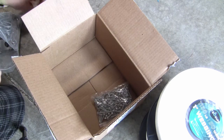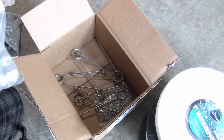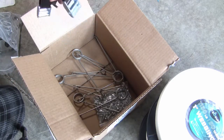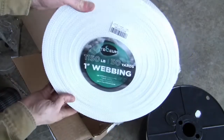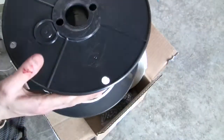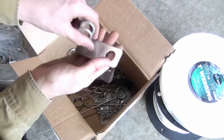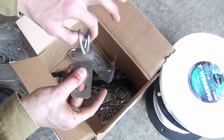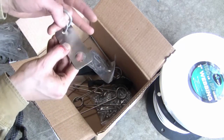So a pack, plus however many tech screws you need, enough side curtains for keeping the plastic lifted if you want. These are pieces to hold on to tighten the purlin strap to the stake. This is the fabric purlin strap, and there's a whole giant spool of all the webbing that we will use to hold the plastic tight. We do it by using these things — we put the rebar through this, hook the rope through this, and the plastic is in between the two, so the plastic is tied to this, tied to the ground.